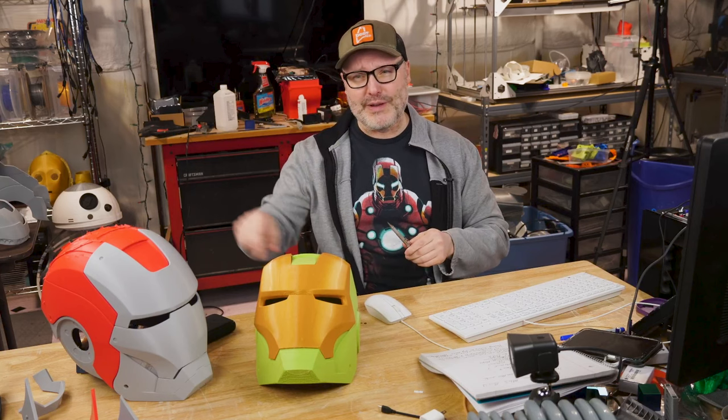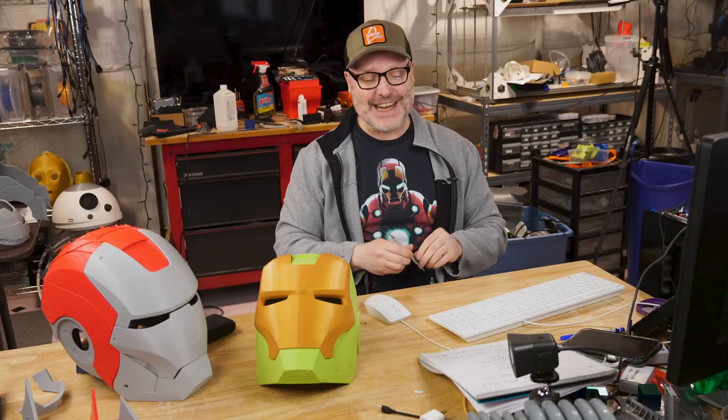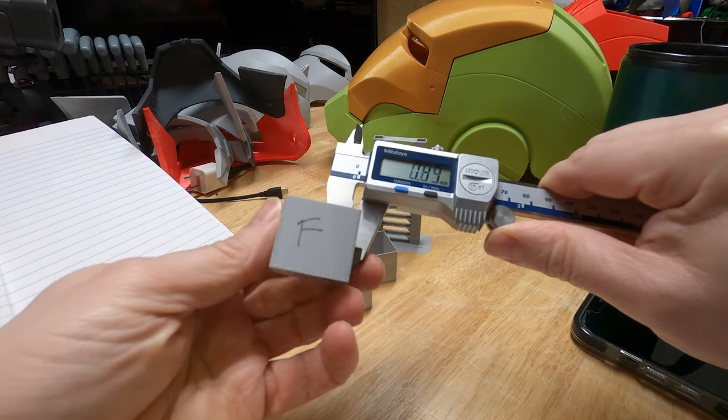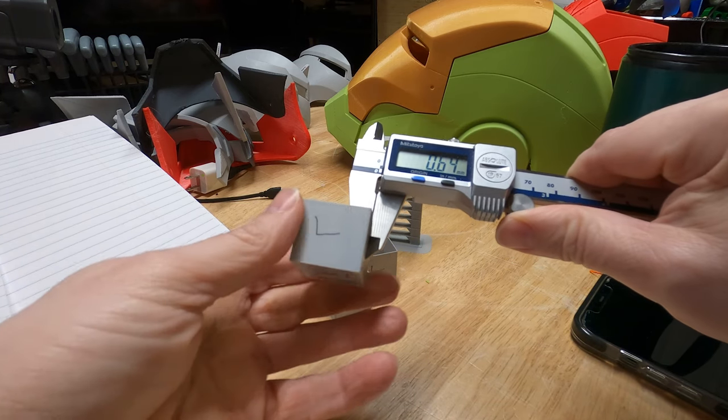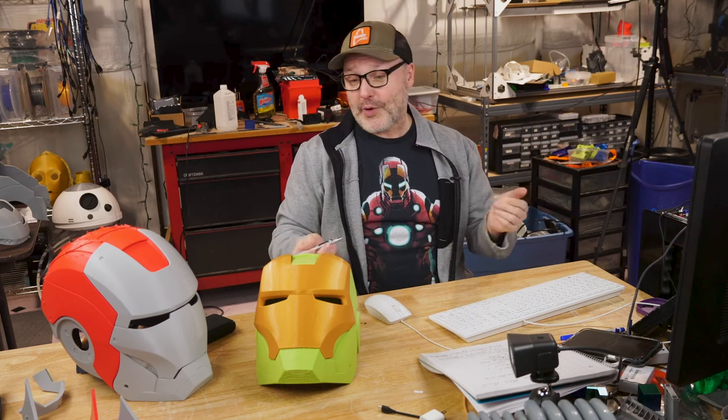After that, I'll do a video talking about 3D printer calibrations. I haven't seen this mentioned a lot — a lot of people just throw filament in and take their best guess. I like to print precisely and make sure my machine is properly calibrated, because these pieces all have to fit together and they're being done across many different printers. You want to make sure that parts from different printers fit together within tolerances. I'll also talk about the materials I use and why.